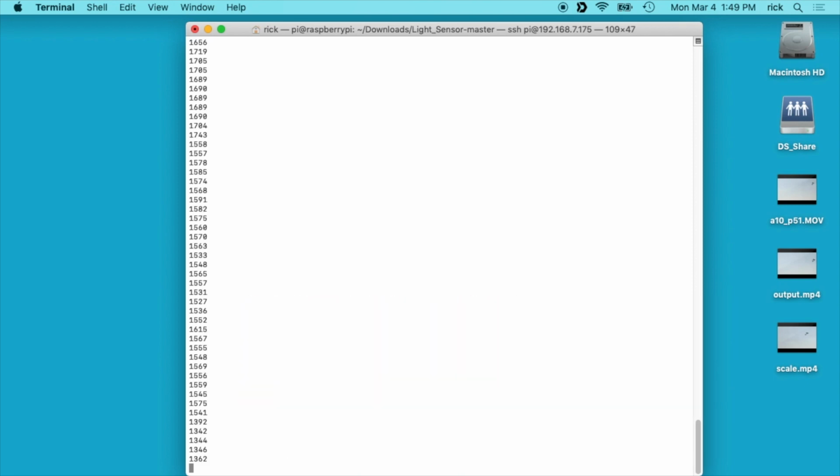So now we know that's working. It'll send me an email. It won't come in on this computer because I have notifications turned off. But what we want to do is have this script run when the Raspberry Pi is started up. And then I'll take this circuit and mount it onto the water heater, and then it should just work. I may need to calibrate the threshold amount.